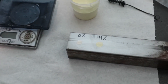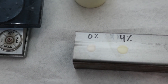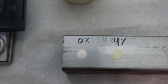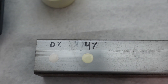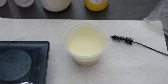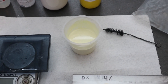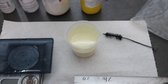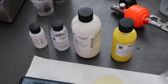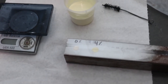I think I got a color I'm happy with. I did a little sample on that scrap piece of metal. We've got the Goddess Ivory which is just the color that came in the bottle, and then I mixed 4% of the yellow - you can see the difference, didn't take much but that's pretty much what I was going for. I just put 50 grams of the Ivory in the cup and then added 2 grams of the primary yellow. At first it didn't seem to want to mix, but they're the same product so it just took a lot of stirring. I'm going to add 4% to the main bottle, pour this back in, shake it up, and we'll pretty much be ready to go.